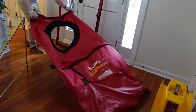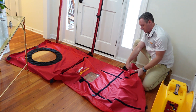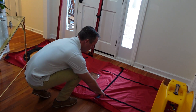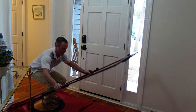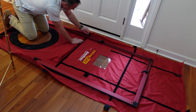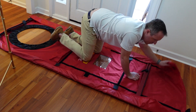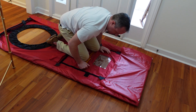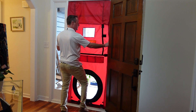There are a couple of different ways you can install the cloth to the frame. You can spread it across the floor like you see here, or you can drape it over the door and install it vertically to the frame. Both methods are correct — it just depends on which one you like best. Here we're going to spread it across the floor. Once we have our cloth prepared, we'll lay our frame down on top and then Velcro the cloth to the frame, starting at the bottom and then working our way up. There are tabs going up along the sides that we will use to attach the cloth to the frame. Once we get to the top, we'll pull the last piece of cloth over the top of the frame and wrap it in like a present. Once the cloth is installed to the frame, we'll open our doorway back up and reinstall the frame and cloth into the doorway.